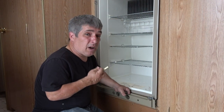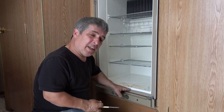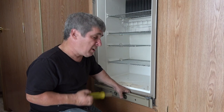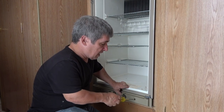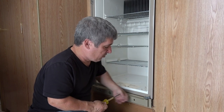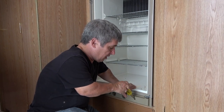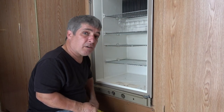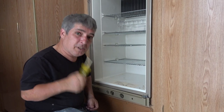Typically what I've found on YouTube is there are screws on the top and the bottom holding the fridge in, and you normally have to take this trim off. I tried getting this trim off but it won't come off all the way, and I didn't want to break it because we may have a chance of reusing this fridge. I realized the screw to hold the fridge in is accessible through the same hole, so I didn't actually have to take this off. Each fridge is different — I couldn't find this particular one on YouTube, but now it will be.